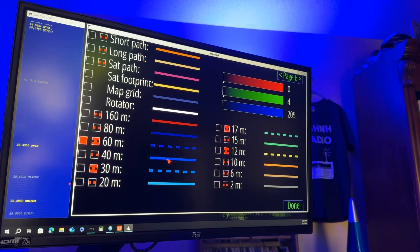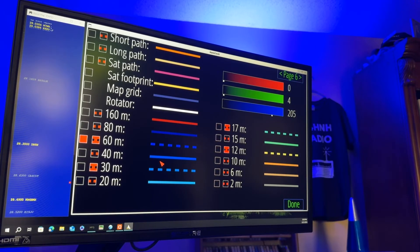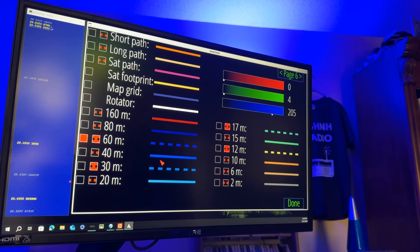40 kind of works out nicely with that blue because 40 is so popular, I use it a lot. Remember, 40 meters is the 23-hour band. During cycle 24, when the bands were abysmal, 40 meters was our friend. I've literally stayed up 24 hours to prove this out — 40 meters only closes down in my area for about an hour early in the morning, like around 4 o'clock. So it's the 23-hour band.